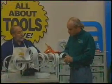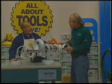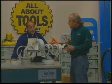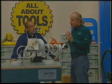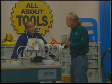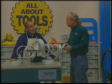That's your countertop size. Right. Well, so you're only ever routing a 1/2 inch of material to bring it back into the template, or into the face of the edge. Face of the edge, which saves tremendous time. Sanding is the biggest time consumer in fabrication. You eliminate most of the sanding, you eliminate most of your fabrication time.